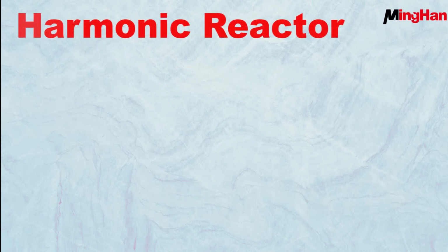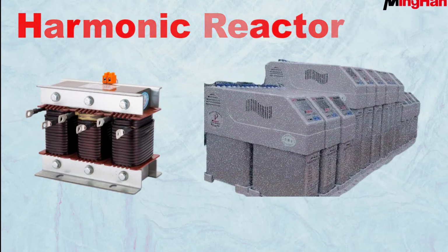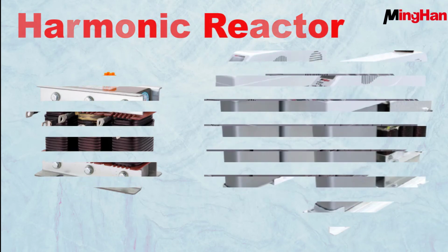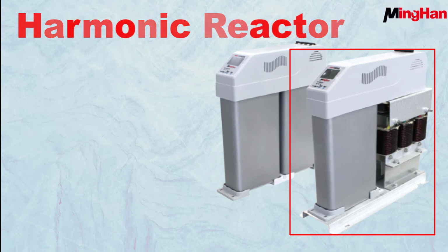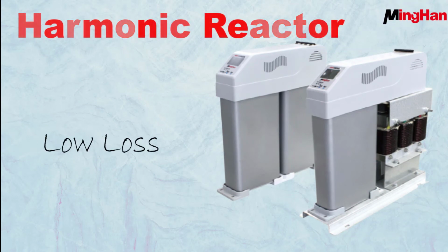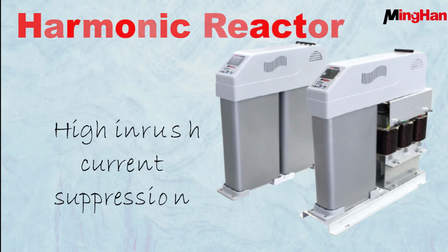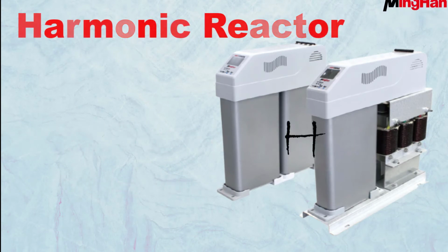Series reactor. As we mentioned earlier, harmonics reactor are added in second version of smart capacitors for harmonics filtration. This reactor is dry type, iron core reactor with reactance rate of 7% and 14%. It has the characteristics of low loss, low noise, high inrush current suppression and highly anti-harmonics. The insulation level is H.